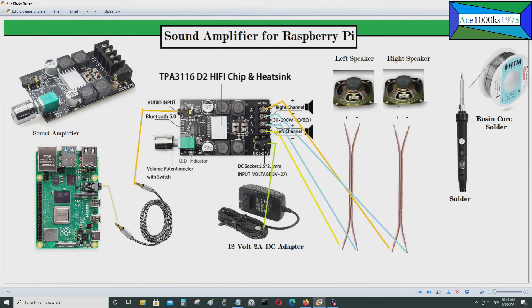I'll leave the board specs in the video description. For my Raspberry Pi, I would connect one end of the 3.5mm stereo jack into the Raspberry Pi and the other end goes right into this amplification board. It's connected to the speakers, so I can adjust the volume with the potentiometer, and I could put it into my arcade cabinet — that's all you have to do.